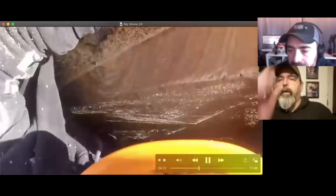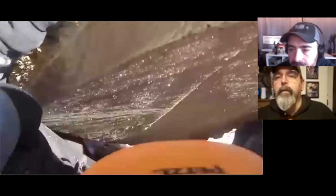So he's down here. Well, first of all, I was looking for that line. And so what it is, here's your tree, and he's dropping it uphill. It's a dangerous place for anybody to be because your escape route has to happen instantaneously. If that tree's 75 feet tall and the top of that hill is 25 feet high, at a slight angle, when that thing comes, there's a whole lot of tree on the other side that's going to lift that butt end up. You see what I'm saying? And it can come right back down, and it's going to come up off that stump no matter what, unless you have a super heavy hinge.